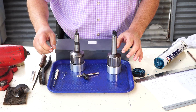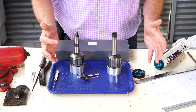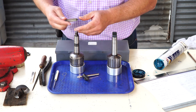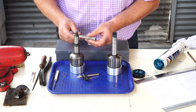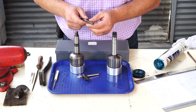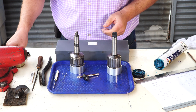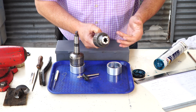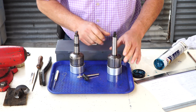These tools are pretty commonly found in your shop. For a deluxe rebuild, you'd put this stuff in your ultrasonic tank. If you get one that's got a really bad burr, you might need to do some reaming on the hole, but between the file, the stone, and doing a good cleaning job — maybe some emery cloth — this has rarely been necessary for rebuilds I've done. The 14-in is super versatile, easily rebuilt, feels like butter. It's ready to go for another 20 to 30 years. Replace the grease from time to time and it'll take care of you.